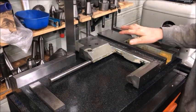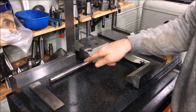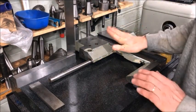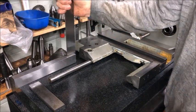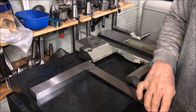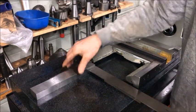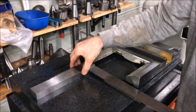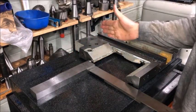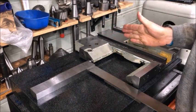This is my setup for testing the in-and-out movement — that it is perpendicular to the bed. I'll try to mimic the bed here. It doesn't need to be flat to the plate, just so that it represents, even though it is a little worn on the side, a sort of bed-like structure, so I can locate the V-way there. I'm running an indicator, and I've already proven it to be within one to two hundredths of a millimeter, which with this rough setup is kind of okay.